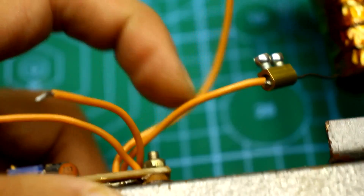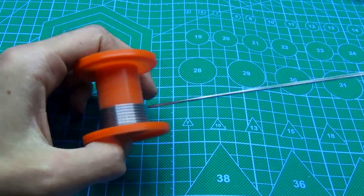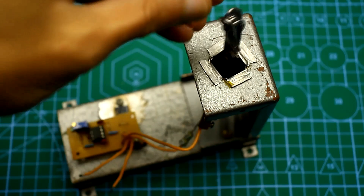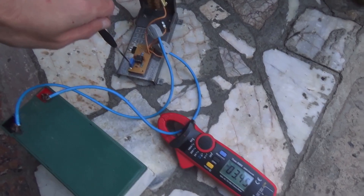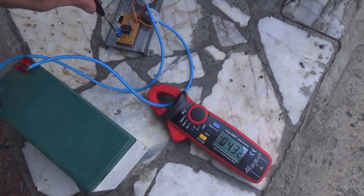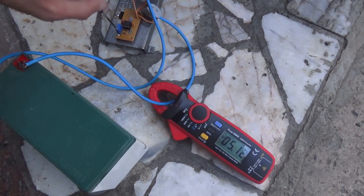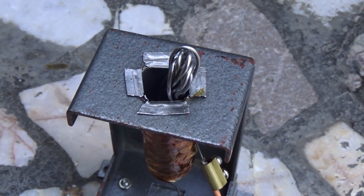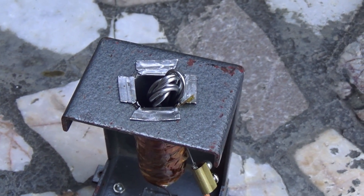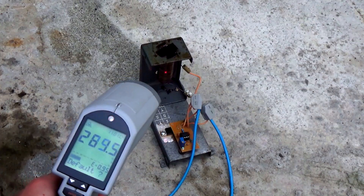Connecting wires are soft, standard wires with heat-resistant silicone insulation. Next, take the worst solder you can find, put it in the bath, and turn it on. To begin, limit the power of the heater to 30 watts and wait some time. If the solder doesn't melt, increase it to 50 watts and wait again. This way we determine the optimal power so that the temperature of the molten solder is around 300 degrees Celsius, give or take. Temperature can be measured without contact using a pyrometer. Now it only remains to check the bath.